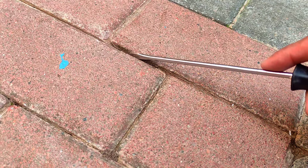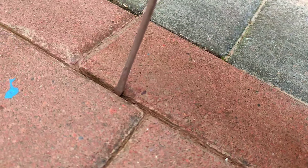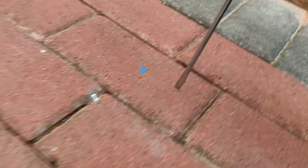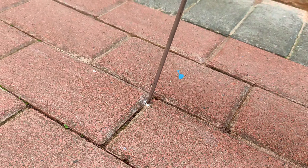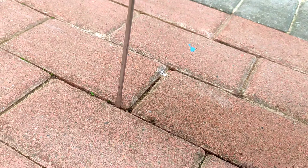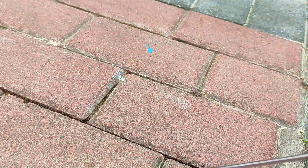So just sand is not going to be good — you want sand and cement. The sand and cement was brushed into the gaps and it did sink down a little bit. You can see with the screwdriver there's about a two or three millimeter sinkage, however that sinkage made a seal and that seal did not allow anything to grow in there. Look back at the last few videos — I made this like a three-part series so you can see what's going on.